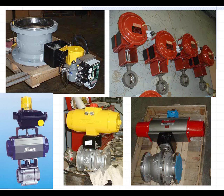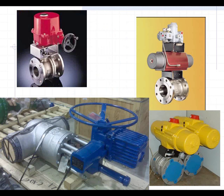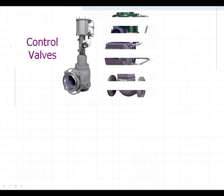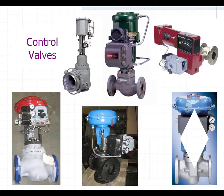Here are examples of all the different types of automation that can go on with valves. The ones you're looking at here are all rotary-type valves. There's a large 8-inch ball valve with a pneumatic spring-return actuator and limit switch, some high-performance butterfly valves, an eccentric disc-type valve with an actuator and positioner, and a large on-off ball valve with a pneumatic actuator. Here's a large gate valve with a big electric motor operator. And there are some high-pressure ball valves — some with electric motor actuators, some with pneumatic actuators — and a big linear valve with another large motor operator. Automation saves a lot of labor these days, and you can get confirmation back in the control room whether the valve is actually open or closed.